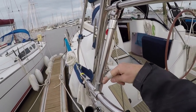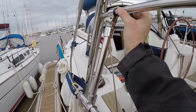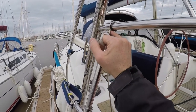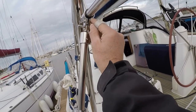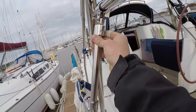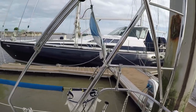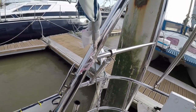So it seems to be working well, very stable, and as I said, I will have to weld the 22 millimeters tube into the small pieces of 25 millimeters tube that I cut to adapt to the stuff. And here there is a bit of space, so you can see it moves a little bit, so I will remove part of the adaptors to squeeze it very nicely so that it works pretty fine.